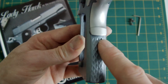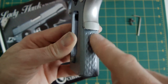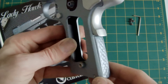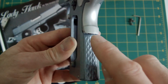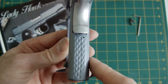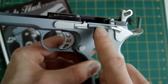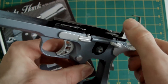I've also drilled out on the mainspring housing for the mainspring real steel pin that would go through there to hold the cup and the spring in on a real steel pistol. I drilled it in because when I ground this down — remember this was an arched mainspring housing from a standard 1911A1 — I ground all that down and made it flush. But in doing so, I ground out the detail for the pin, so I re-drilled it where it should be, and it just adds that bit of authenticity to it. The plunger spring tube has been sprayed the same as the frame, and the springs have all been reinstalled.